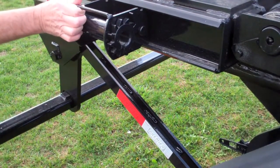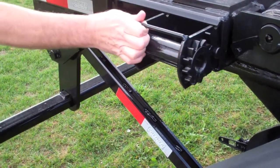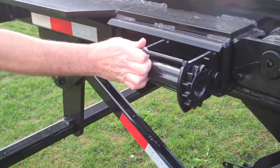The ratchets slide in channels to line up with the spaces between the cross sills on the container. Both systems require an open space between the cross sills and space above the long sills to allow the systems to engage the container long sills.